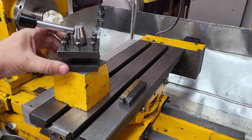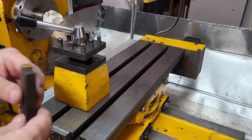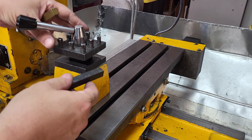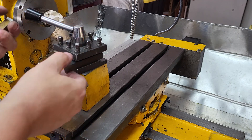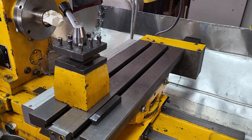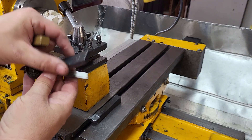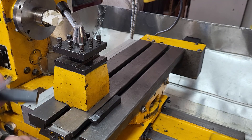The standard tool post is one of these four-corner turret ones which, if you use the half-inch shank tools, will take it up to 100 millimeters thereabouts. There's a little bit of variation and not a lot of adjustment - you can shim them up but obviously you can't go down. I did at one point add a cutoff tool which has a higher size and I had to mill away some of those tips to have somewhere to put that.